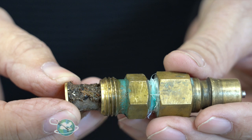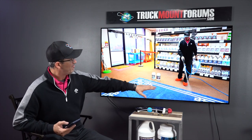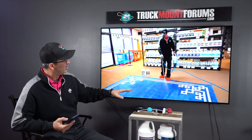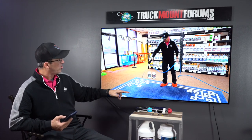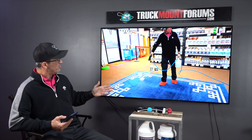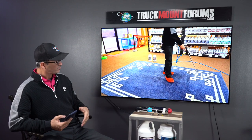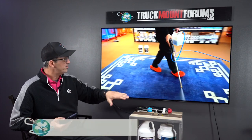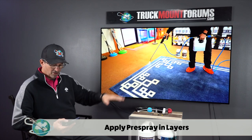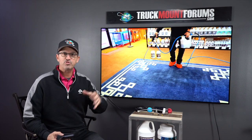Now here's a demonstration of me actually pre-spraying. Notice I'm about 12 to 16 inches from the surface, using a fan and cutting it off at the end of each stroke. I went up high to show you that's the improper way because then you're breathing the product. Too close and you're oversaturating the carpet. Keep yourself about 12 to 16 inches across and don't stay in one place for a long time — just work your way back and forth. If you want some extra pre-spray, put it on in layers. This gives you much better results when you go to clean. Just layers — don't oversaturate, but keep it wet. You don't want your pre-spray to dry.